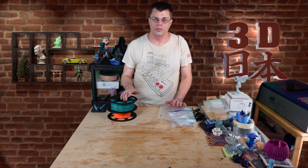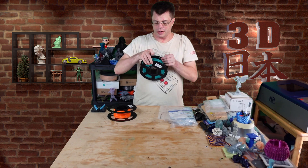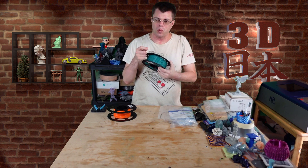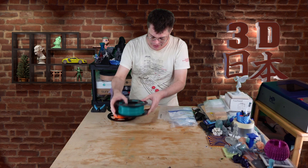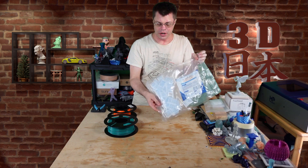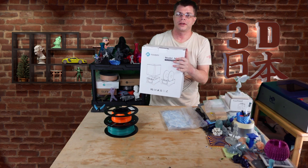It has been really hot and really humid lately and I've got a couple of these spools of filament where the filament has gotten moisture to it and it just snaps — it'll just break apart while I'm printing, and that ruins the print. I tried putting it in a baggie full of silica gel desiccant packs for about a month and that didn't help. So that's where this comes into play.